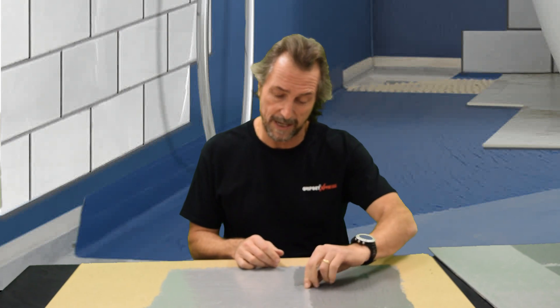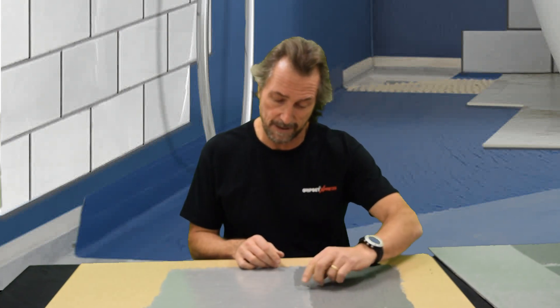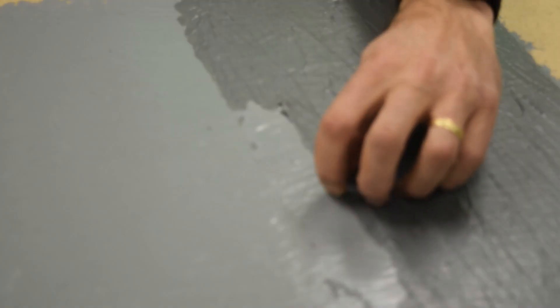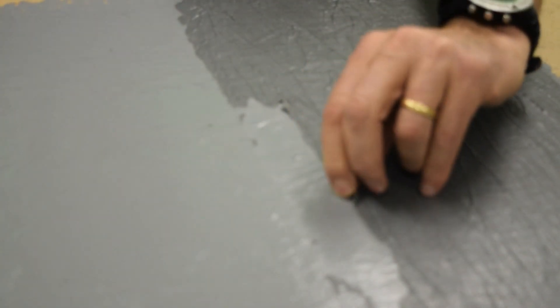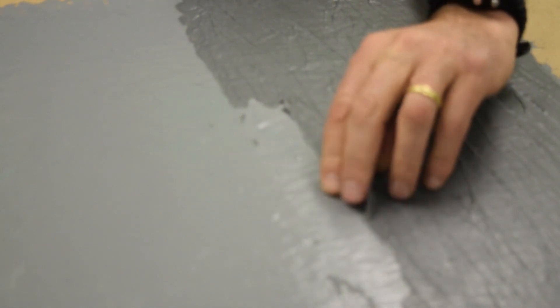You'll see how that happens — this is a membrane that's basically been exposed to a wet edge. I can just peel the top coat of the water-based system like so. That is a big issue, and the problem is that when you're tiling in a wet area you're going to have a separation over time. I speak to a lot of our customers who use PU membranes because it gives them a nice heavy-build film, particularly in the winter months.